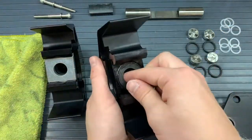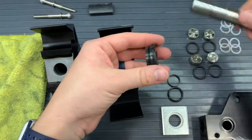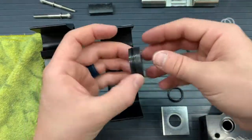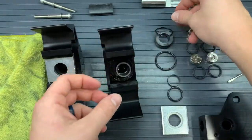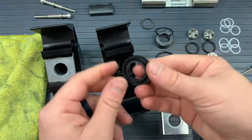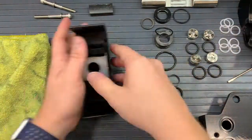We'll slide that to the side, and it might be a little tricky, but you can try to use your finger at first. It'll get a little dirty, but just to get that plunger guide and all those pieces inside the pump head out. If that doesn't work, use the plunger, kind of wiggle it around in a circle or slightly back and forth, and that should pop off the plunger guide. You should be able to get off all the parts inside.